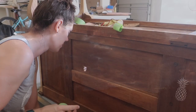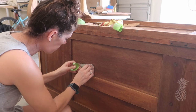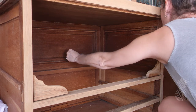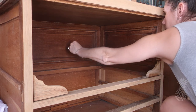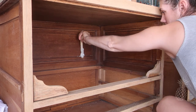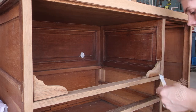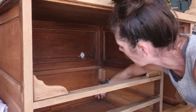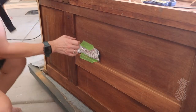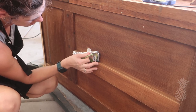Why is there a hole in the back of this, Danny? I'm sure someone was using it as a media console, so they put their wires through there, which is really unfortunate because now we have to paint the inside once we cover this hole up. What are you using to fill in the hole? My favorite Bondo. We have a flat part on the back, so I'm just going to seal it with some aluminum foil so the Bondo can go right up against that. That's a good trick - it worked perfectly.